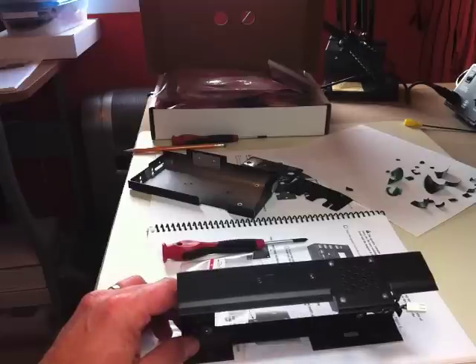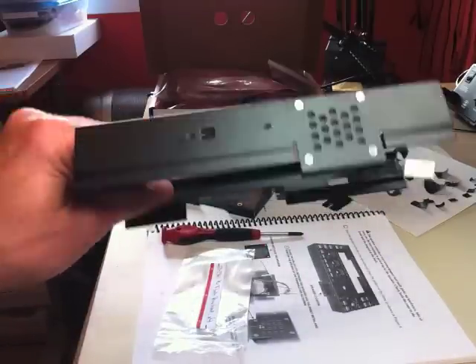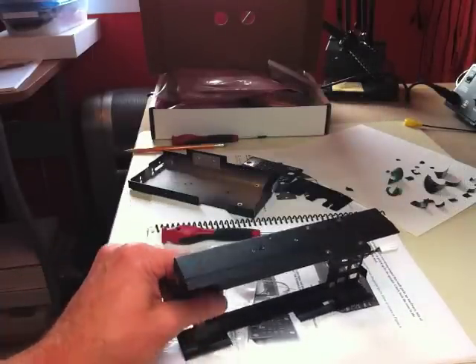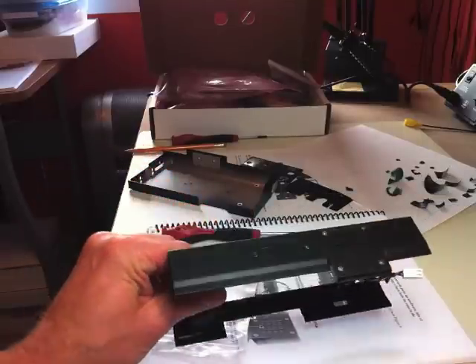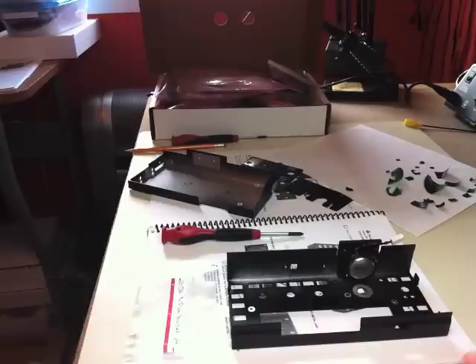Another thing I encountered while assembling the speaker: there are four screws that hold the speaker to the metal frame. During my parts check I found 2-56 1/4-inch screws — nice shiny zinc screws — and also some 2-56 9/32-inch screws, which is a very odd size. I went through the checklist as explained earlier. What also comes with the Elecraft manual is an errata sheet, which contains changes not yet incorporated into the printed manual.